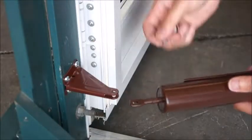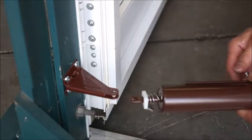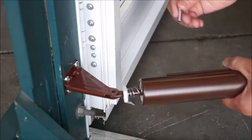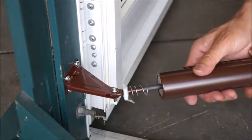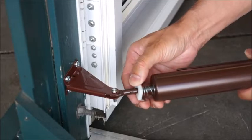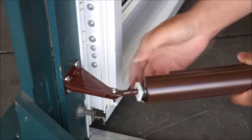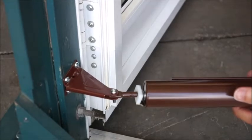Now open the door and slip the hold-open washer onto the rod. Attach the door closer to the jamb bracket using the closer pin. Pull open the door closer a bit. Slide the washer past the lugs, lining it up with the mark on the rod. Release the closer so that the washer is now holding it open. This is called pre-tensioning the closer.